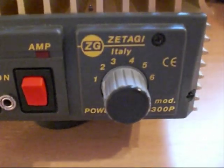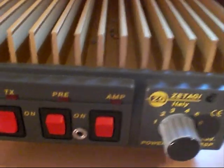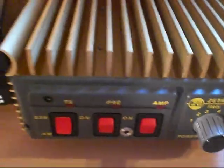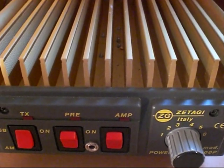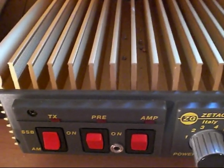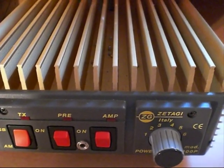It's all back in one piece. I've fitted two new Motorola MRF455 devices — the originals were SD1446s as this was a later model. Interestingly the slots cut out in the board will accept even larger devices, something I'll be experimenting with later. Possibly MRF421s or Toshiba 2SC2879s could fit — they will physically fit, the slots are big enough on this later amp. Those are of course 100-watt devices and can take more drive.